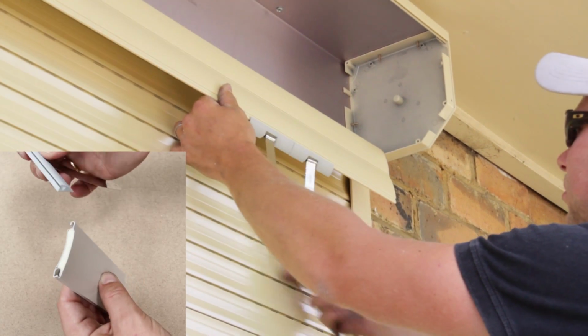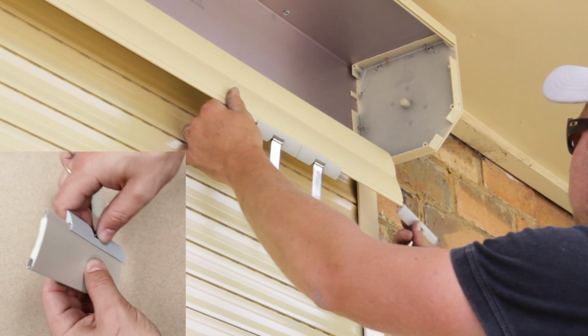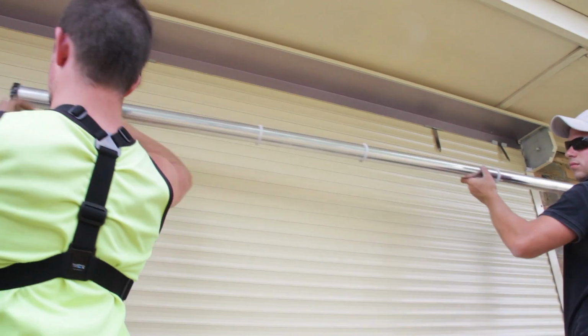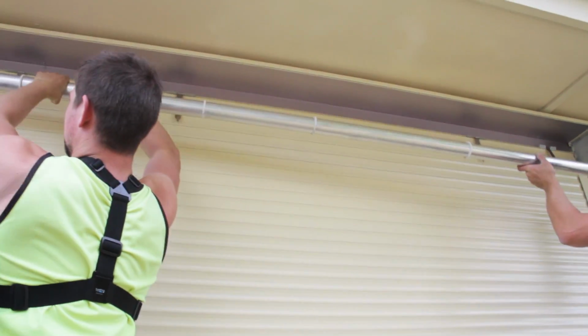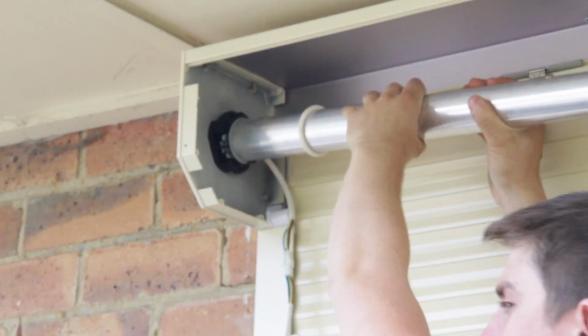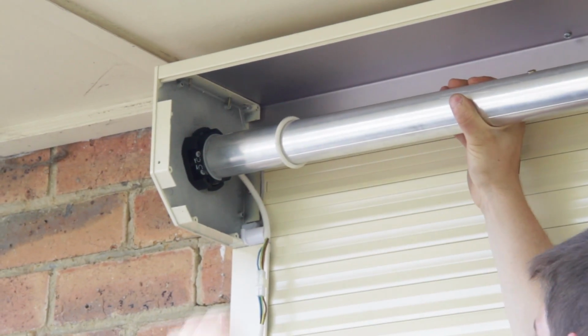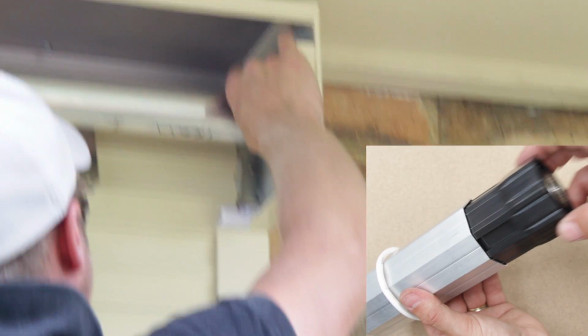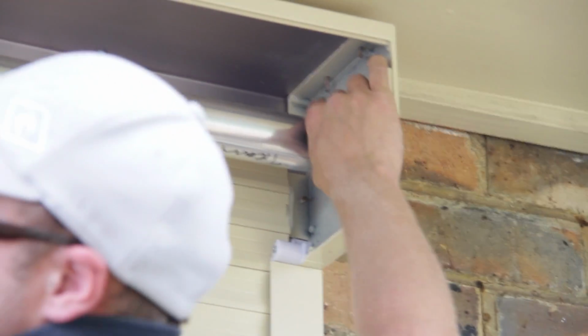On the top slat, you install the springs. They hold the axle, or top tube, to the curtain. At this point, you should call your electrician and get them to connect the power so you can set up your motor limits. Now put your pre-prepared motor into position by clicking the motor end first, into the bracket, and then following by extending the telescopic end and screwing it into position.